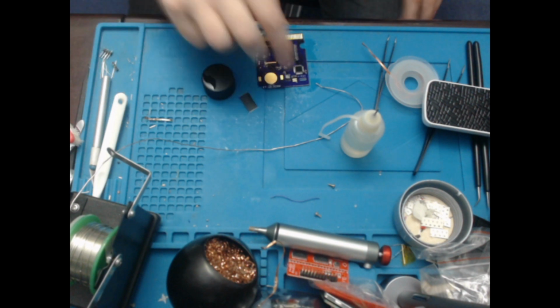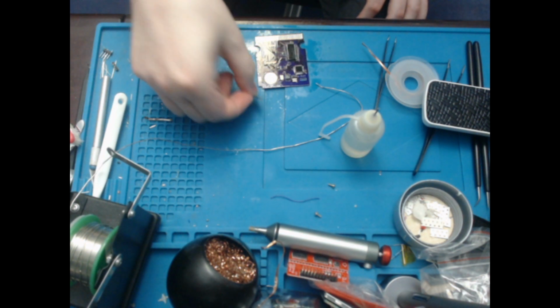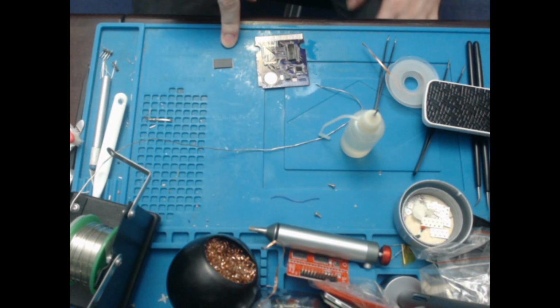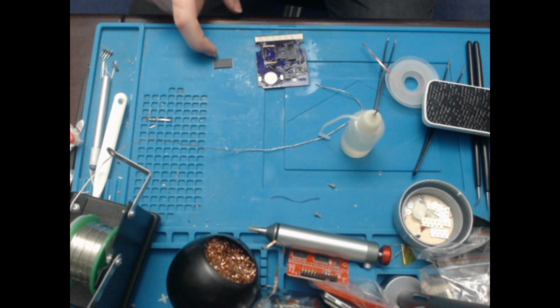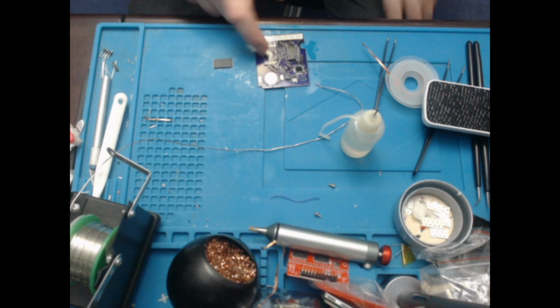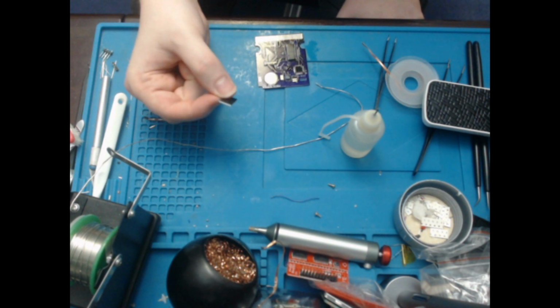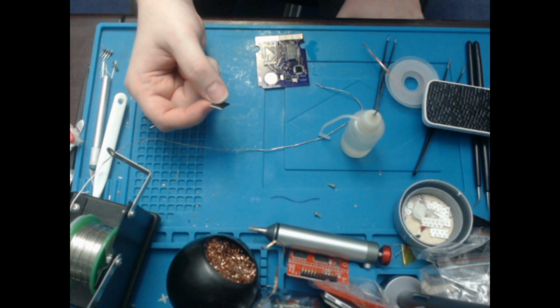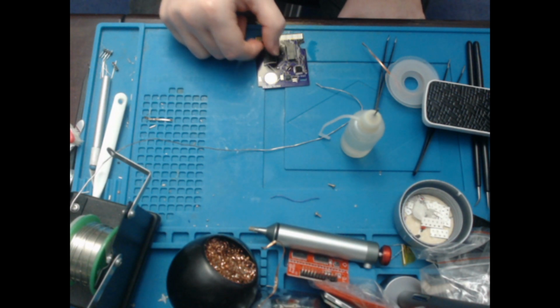And now comes the important part, which is the flash chip itself. So when it comes to this, this is a TSOP 48 footprint on the PCB itself. The 29F433C does not have 48 pins. It's got 40, I think 40, yeah.